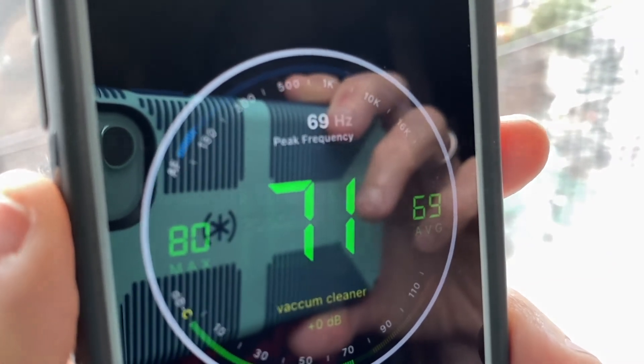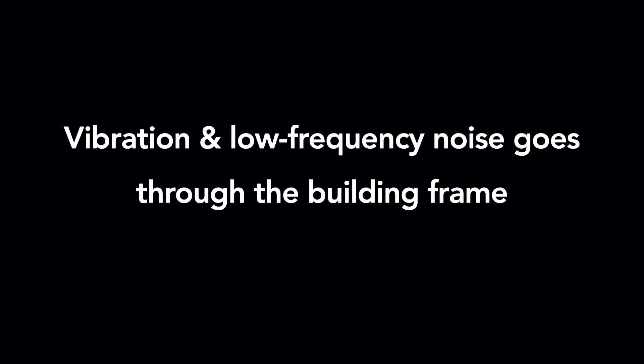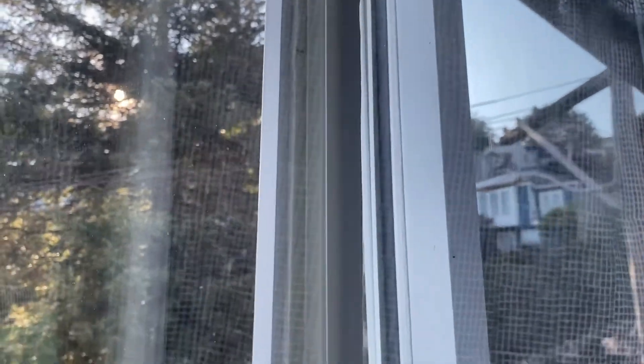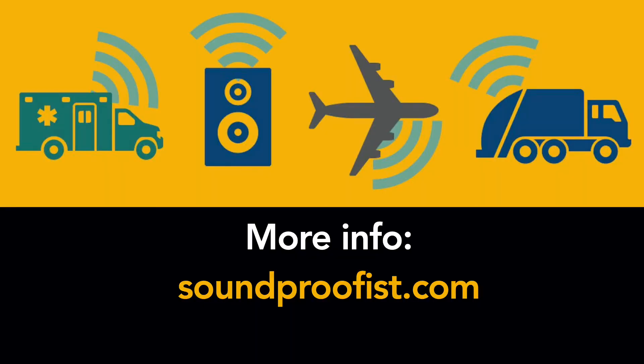In summary, machine vibration and low frequency noise will go right from the ground through the building frame, so just adding a sheet of plexiglass doesn't make a huge difference. Where you do hear a difference is when a car engine idles outside the window, or a car or truck drives by without revving the engine, or when people are talking outside or there's distant noise. But a cement mixer or jackhammer right outside the window is not going to be greatly reduced by just these plexiglass window panels by themselves. Thanks for watching, and if you're thinking about adding plexiglass to your existing windows, I hope this was helpful. For more information on noise and acoustics, visit soundproofus.com.